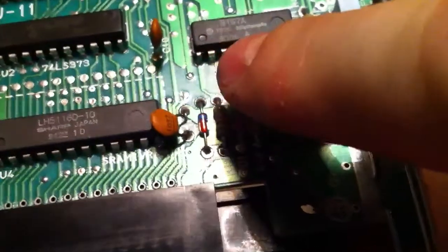Once that chip is disabled, you can play American games on a European Nintendo and vice versa. If you're in America and want to play European games — some were not released in America — this mod works the same way. To recap: hold the board with the RF modulator on your right, and disable the fourth pin from the left — one, two, three, four. That's pretty much it, thanks for watching.